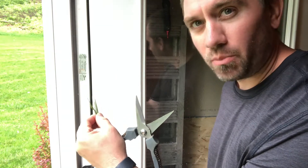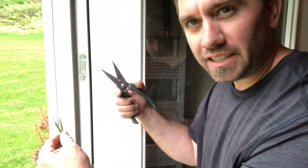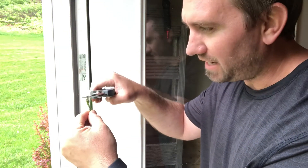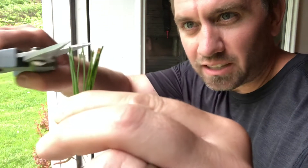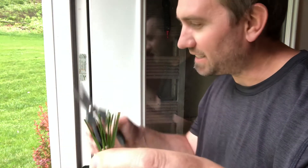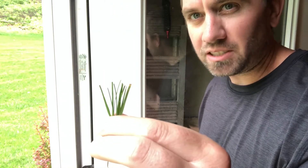Man started cutting grass with a reel mower, which is much like a pair of scissors — you've got the blades on the reel and a bed knife that creates a shear on the grass. You can see that creates an incredible quality of cut: a very nice, even cut across the top, very low energy. It makes the grass look quite good. Now that's very labor-intensive — the maintenance to keep the gap right on the blades and deal with rocks and sticks. Reel mowers are pretty much a thing of the past, though they're making a little comeback with the low-cut trend.